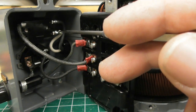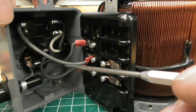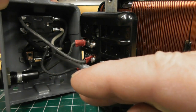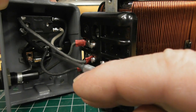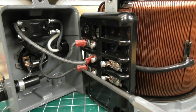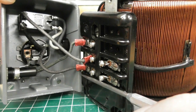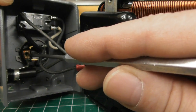The neutral wire right here goes across the switch, jumps down to the receptacle — hopefully you can see it — it comes down this way and is tied onto the neutral side, which is the silver side of the receptacle. From that same connection point, the neutral carries on to pin number one, termination number one right here. On the other side we've got the hot side of the switch.